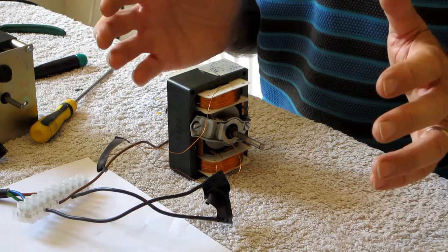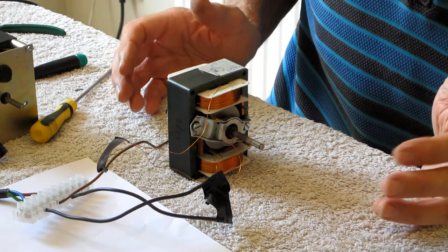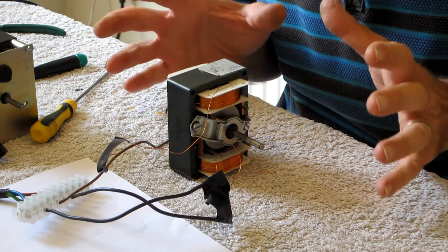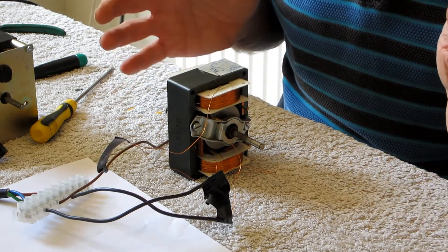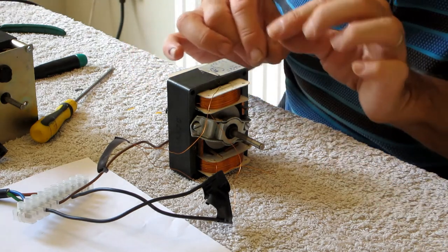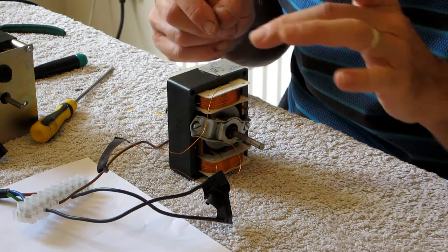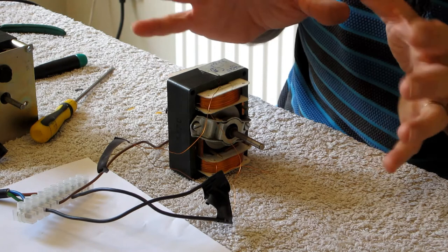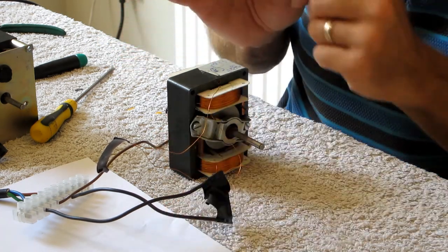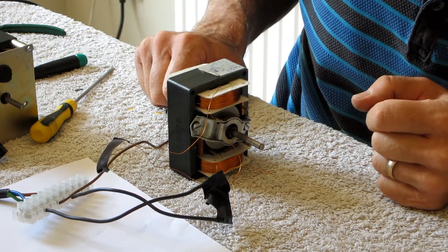That's up to 40% of 240V, so that's probably the normal working voltage — it's spinning and looking really good, fantastic! So now the next stage will be to strip it all back down again. I'll disconnect this, take the coils out, varnish them to seal the windings in, tape them up to make them insulated, tape these lead-outs, and terminate them with some wire properly. When that's done I'll have a fully working and rewound motor.